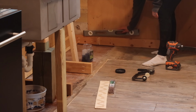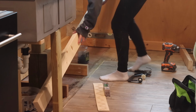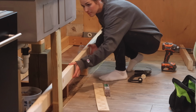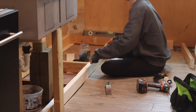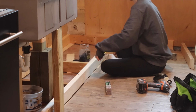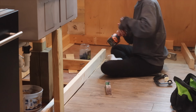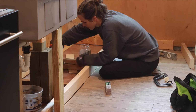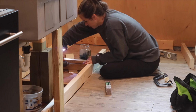In order to keep my sink functional, I jerry-rigged this situation that you see to the left. And because of that, I had to build my framing for my new cabinets in place piece by piece, as you see here. That way we could have a functional sink in the space and a functional dishwasher as renovations continued. So this 2x4 framing is going to serve as support for my lower cabinets since my walls are kind of wonky in this old house.